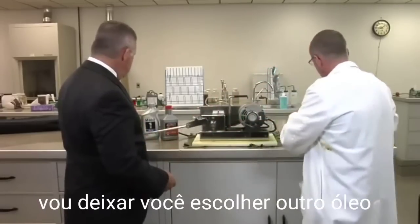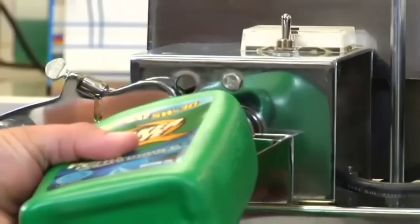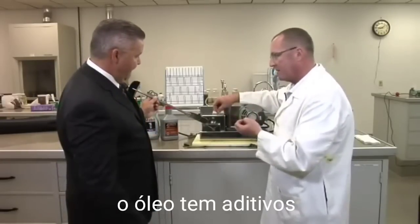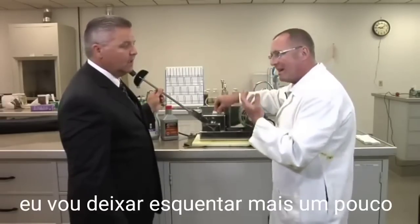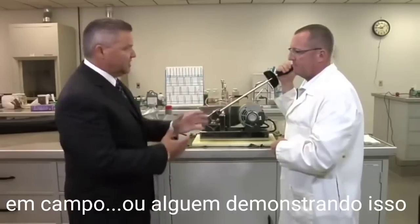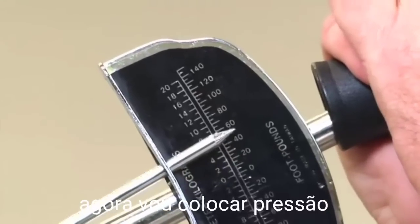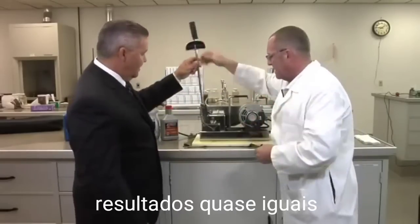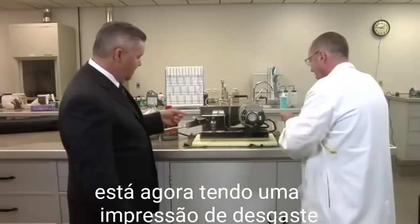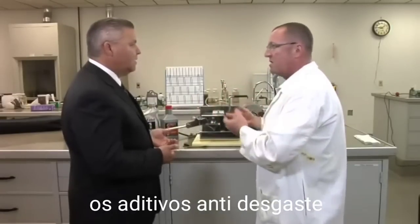We'll take some Quaker State for peak performance. Keep in mind, oil has additives — anti-wear additives that react with heat. I'm going to let it heat up a little more and let's see what that shows in the results. You can picture this happening out in the field — somebody demonstrating this, letting the arm sit on there, maybe adding a little pressure. That came in at about 60 foot-pounds. The bearing stopping the roller is also getting a larger wear print, which allows the surface to accumulate more anti-wear additives.